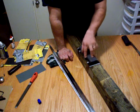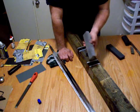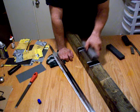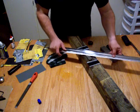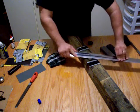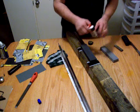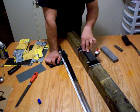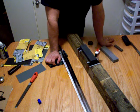I work coarse then fine on the first stone. Then I like to go to a second stone where even the coarse side is finer than the fine side on the first one. And finally, I've got this little Arkansas stone — it may look small and silly, but it works. Just remember with the stone: always use plenty of oil. I like three-in-one household oil. I don't really care for the honing oil they sell in stores, so I use three-in-one oil.